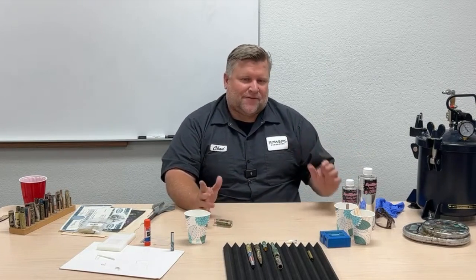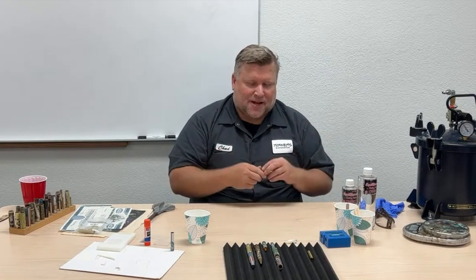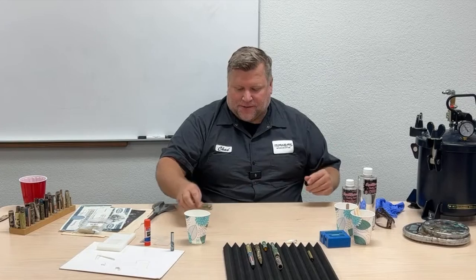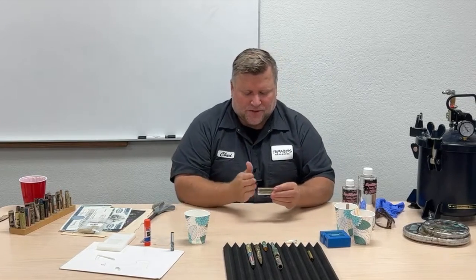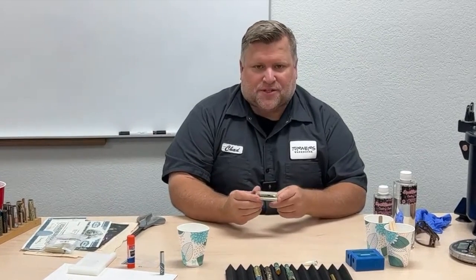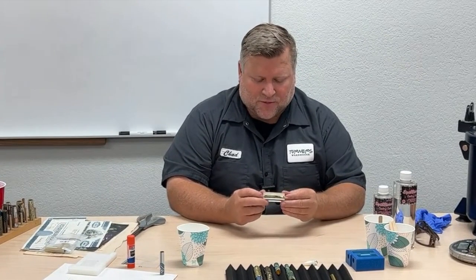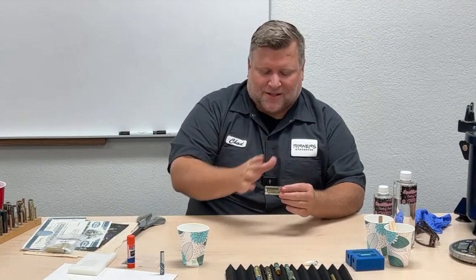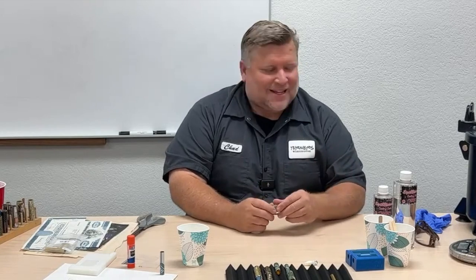Urethanes you can demold after 2 or 3 hours. But like I said, I like the epoxies for this type of casting. So that's what I use. So you are going to get a block like this. When you're done, you will square it. I always use the squaring jig on the belt sander for this type of pen blank to square. I think it's just better with the epoxy, and I can see it. It's nice and clean. And then you are ready to turn. It's that simple.